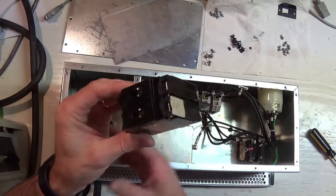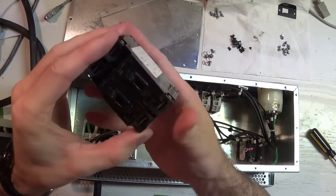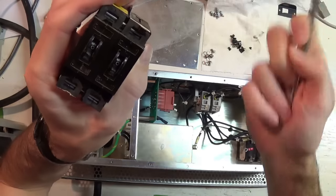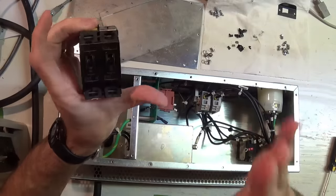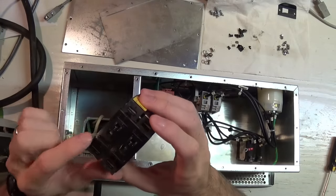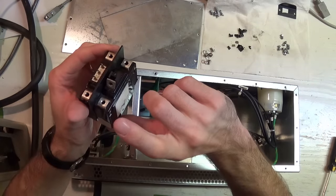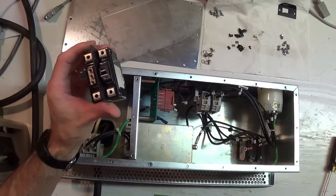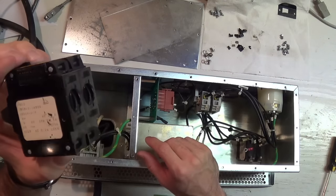These are the original covers here — we've got the screws that retain the covers, and then these bits and pieces over here are the remnants of the original breaker, which right now I still have partially hooked up. So this is the original breaker — power in, power out. We should have our trip lines here. However, if I pop one on, you'll see they instantly pop back off. This is what's left of the retaining bar that used to go there. Clearly something smashed into the back of the rack and has shattered all of this off. Most of it was on the inside. The retaining bar I touched very gently and it fell apart in my hand. I'm guessing it's instantly tripping because something's damaged on the inside. It has a remote trip here — this wire here — so when the mainframe requests that the system power off, it'd probably fire something down here and that'll trip the breaker electrically. There's just not much left of it.